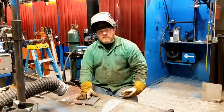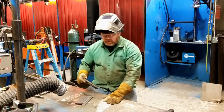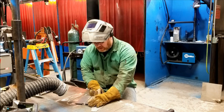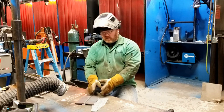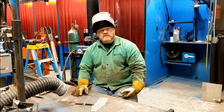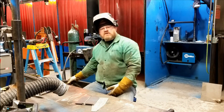What we're going to do here is just fit this up. I've got a quarter-inch backing bar under here and a piece of eighth-inch aluminum I'm simply going to place on this side to create a misalignment of about an eighth of an inch over the width of the plates. I'm going to guess that after welding, this thing is going to be reasonably straight. It's a guess, but to demonstrate the concept, we're going to do it anyway.